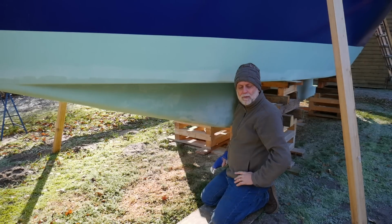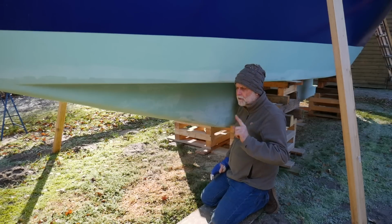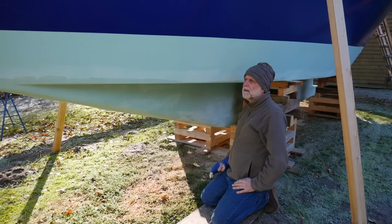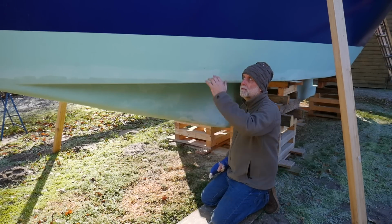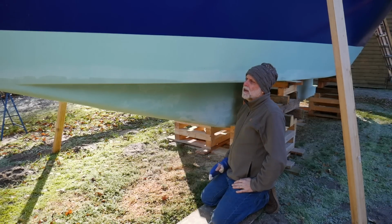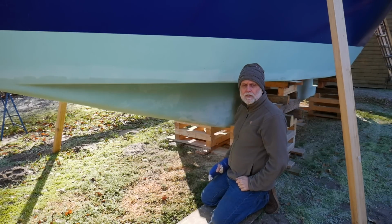I'm not sure whether I'm going to put a boot stripe around. Karen and I talked about it, we did decide to, so I may well still put a boot stripe. It's not a final decision, but I may well do. She'll look nicer for it, that's for sure. But of course I'm not 100% sure that the waterline's in the right place at the moment, so I'd really like to launch her, and I should probably haul out again next winter. So maybe we'll wait for next winter for that boot stripe. Just do it with a plain anti-foul up to here. And then after a season of sailing, we'll know exactly where the waterline really is, which is loaded down, cruising rig, cruising loading, and then have the chance to change the waterline and then do the boot stripe. I think that makes the most sense.